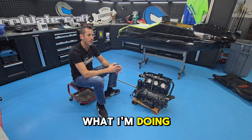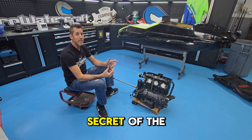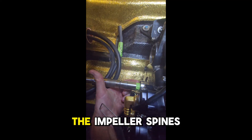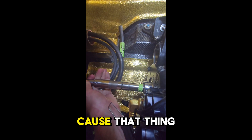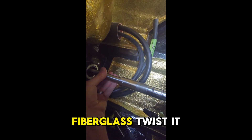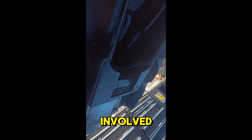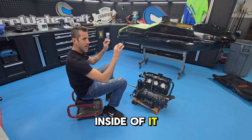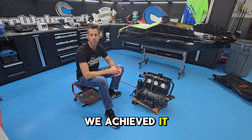You can see a little bit of what I'm doing — it's hard to explain every step. The secret is just making sure that when everything is tightened down, the drive shaft moves in and out of the impeller splines to the engine with the bearing support. Fiberglass twists and changes how it gets glued together — so many variables involved in perfectly aligning the engine to the pump and everything inside with perfect tolerances. We achieved it. This is what we do.